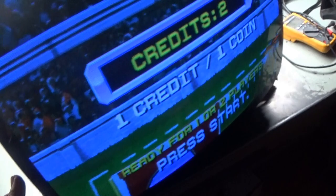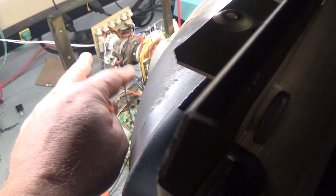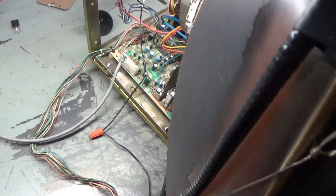We have all three of our colors, so it turns out that that transistor probably does need it installed backwards because the emitter and collector are backwards. So another interesting find there. And it's working. So thanks for watching. Let's get this all cleaned up and come back, and we'll see how the cleanup turns out, and then we'll do some more testing and see what happens.